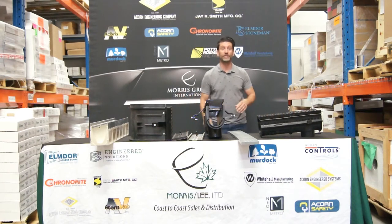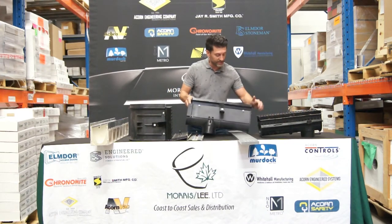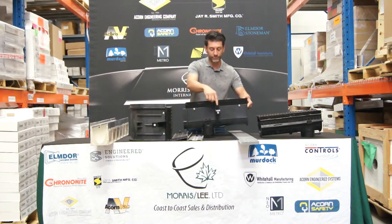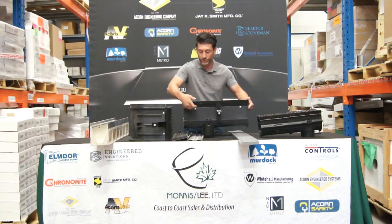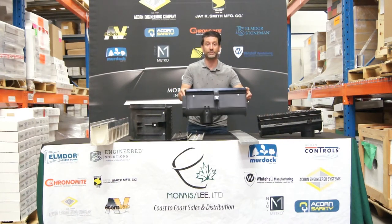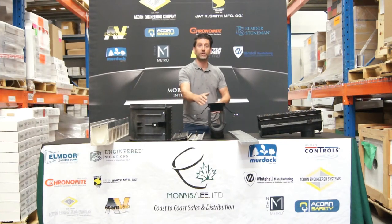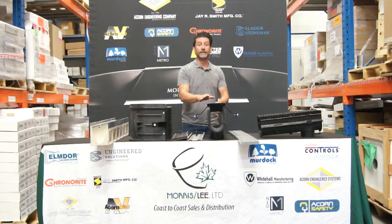The next system we can offer from JR Smith is the 9940. It is similar to the 9931 — 6 inches wide and polypropylene. It has rebar tabs to keep the unit straight and anchor tabs off the side to secure into the cement. The frame is designed so the cement can go underneath to properly secure it in place so it doesn't move. The game changer here is that it's three meters long, which none of our competitors have, making the system really labor friendly to install.